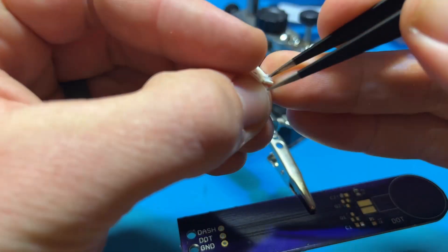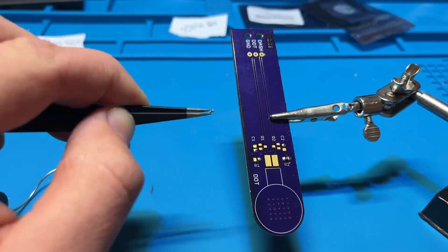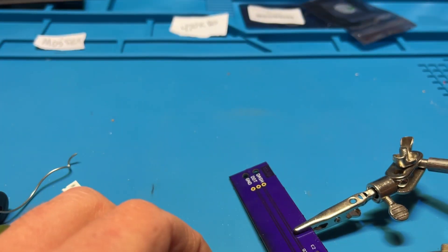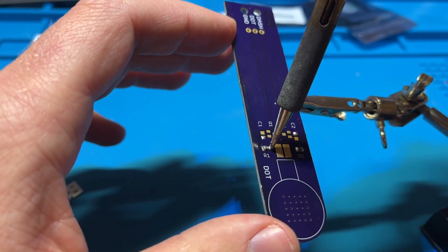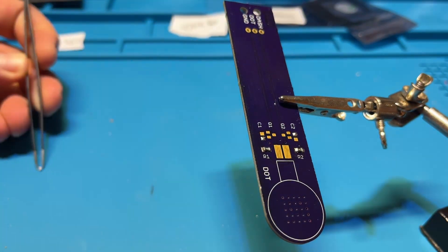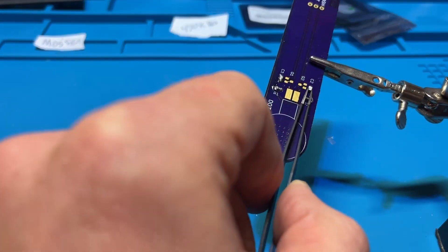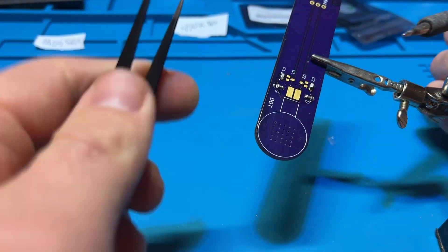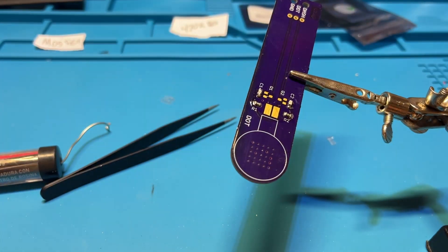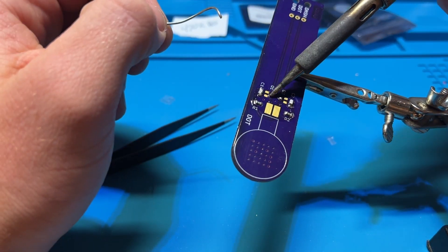These little circle pads I didn't talk about earlier — these are going to have a 3M sticky, and that's the little pressure paddle on them. So you need to make sure those are very clean with no flux underneath, because that's going to stop those pads from sticking and they'll flop around. I took these paddles out on a POTA activation — about 27 contacts in 45 minutes. Worked pretty well. We'll see how the longevity is; this isn't a review video, but they work pretty well and I'm happy with them.